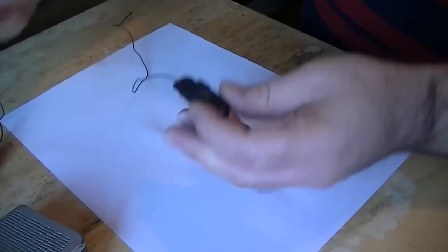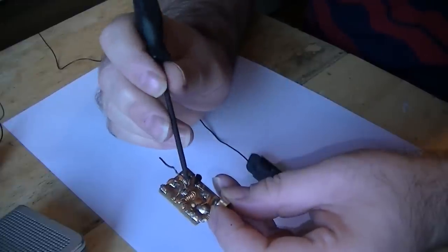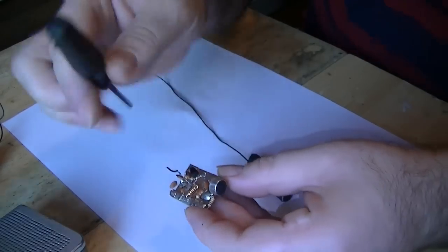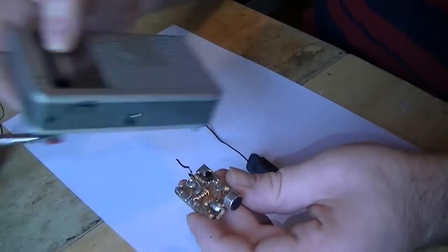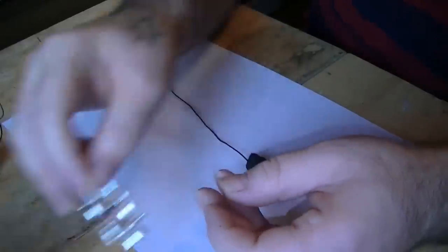Now if you're a subscriber, you'd know that I normally build these type of things. These are easy to build. These are very simple. They just use a Colpitts tank circuit for the oscillator. But if you get near the antenna or touch them, the frequency will drift. They're very simple circuits, got good sound quality, and you can just use a normal standard FM radio and tune into them. Great, a good starter transmitter.